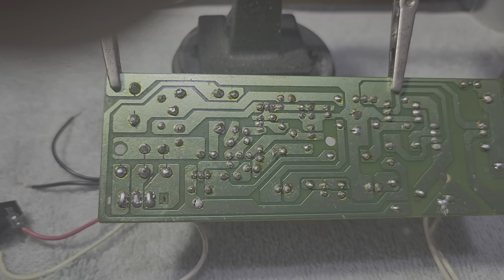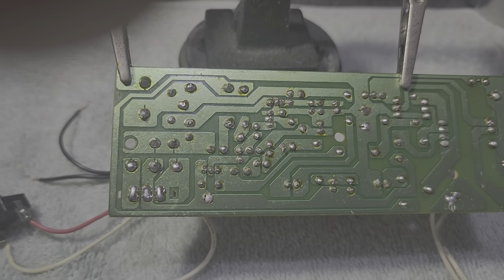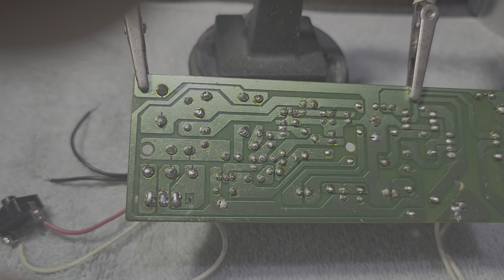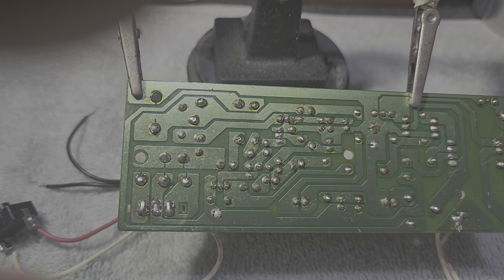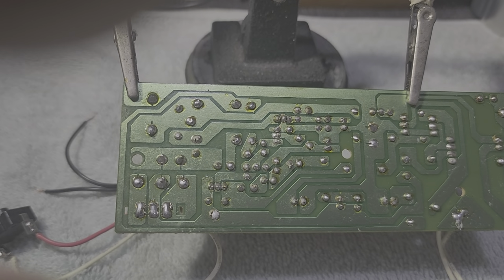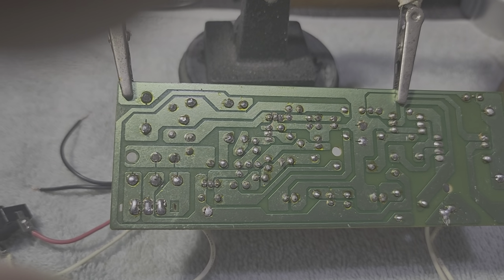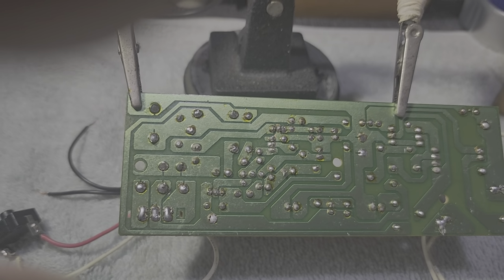This is Professor David J. De Los Reyes. This is one way on how to troubleshoot a not responsive circuit when you are troubleshooting. Okay, this is the so-called reheating the solder terminals, so they will be cone-shaped, but avoid shorting the other terminals when you are doing the soldering.